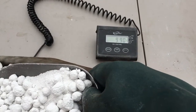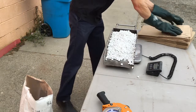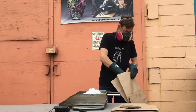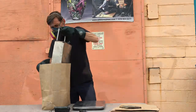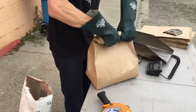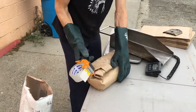There it is, about 10 pounds, and now I'm going to put it into this grocery bag and tape it up. Another advantage of having the batch bombs is that you don't have to pour the batch each time you put it into your furnace, which makes a bunch of dust and pollutes the air quality in your shop. You can also just throw the paper bag and all right into the furnace, which helps keep the dust down as well.